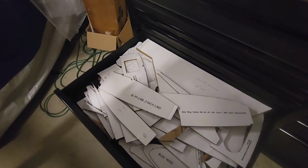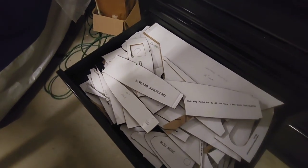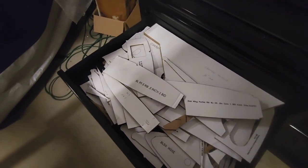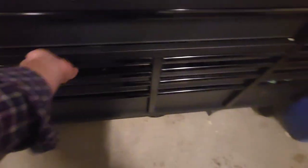From the cardboard cutout templates I'll be able to adjust the DXF CAD model and then I'll be able to run a CNC router - a tabletop router - at a makerspace here in Houston, and cut all the actual parts out of the Nomex honeycomb sandwich panel with CNC precision. I'm actually able to get the panels for relatively cheap - under about a thousand dollars - which really surprised me. They are also fire retardant, and they're built by an aerospace company in San Antonio, so I'm buying them direct from the factory.